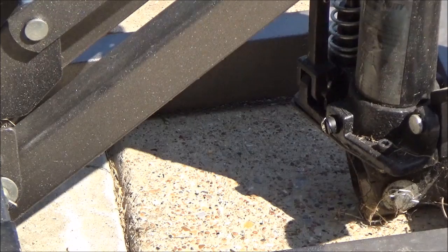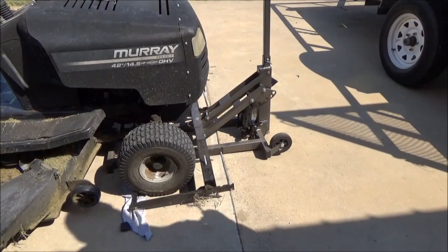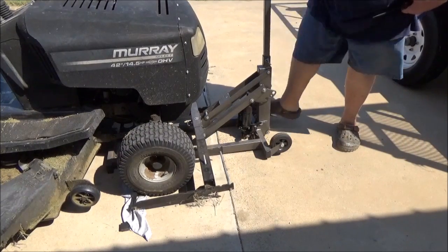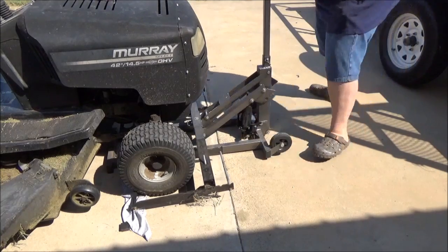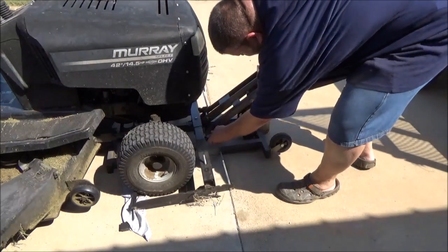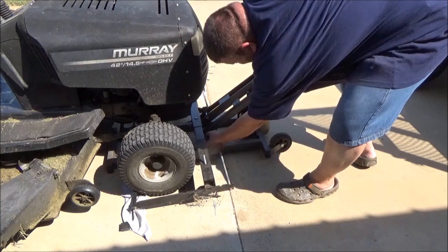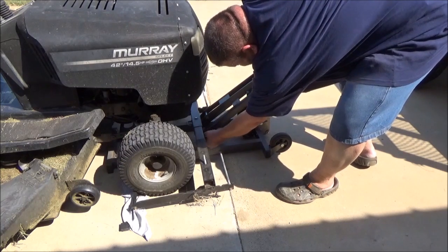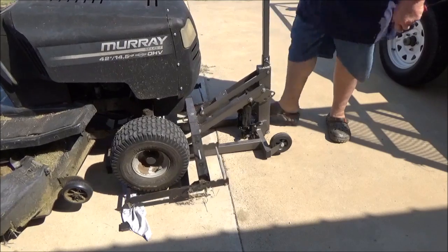Well, that's the bypass, and it comes from the factory not set correctly. So pull that red cap off and turn that screw in until it stops. I've turned mine out for demonstration purposes — I'm going to pump it and show you it doing jack squat. All you've got to do is tighten the screw up until it stops.